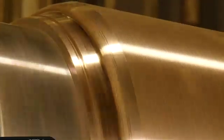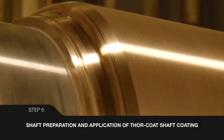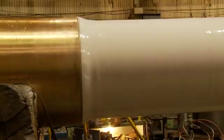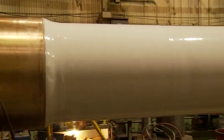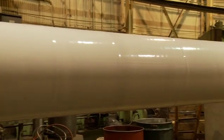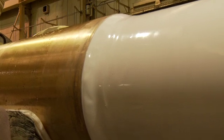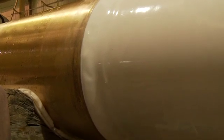This stepped taper cut with a special profile radius tool will be roughened and sealed with an application of Thorcoat, a two-part epoxy coating providing extended shaft corrosion protection. Sandblasting, followed by thorough cleaning with MEK to remove any grease residue, has prepared the shaft for Thorcoat.